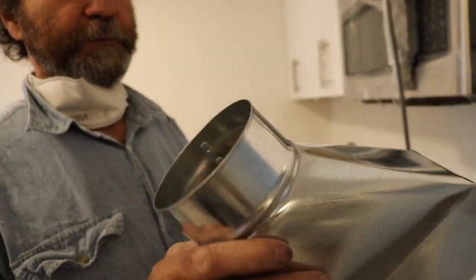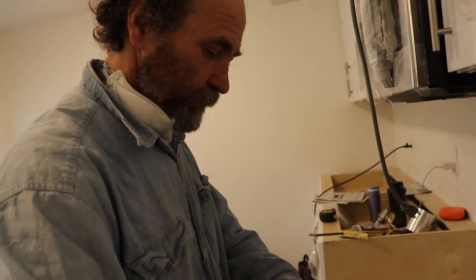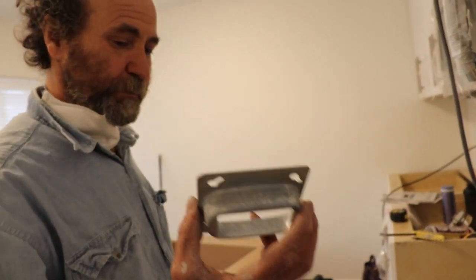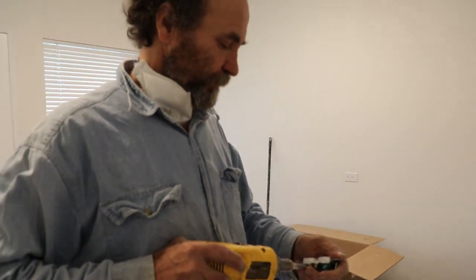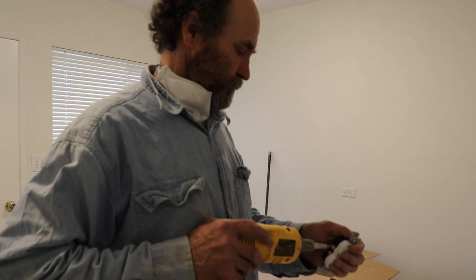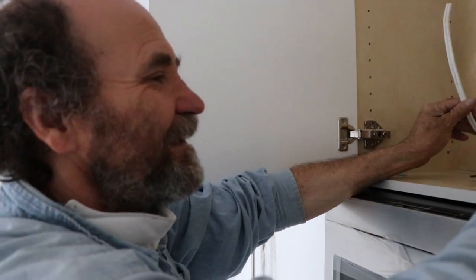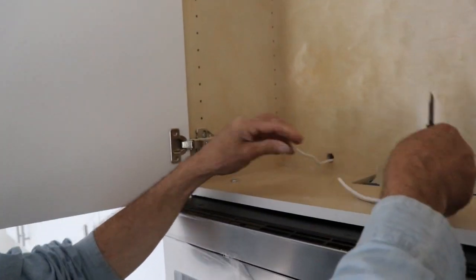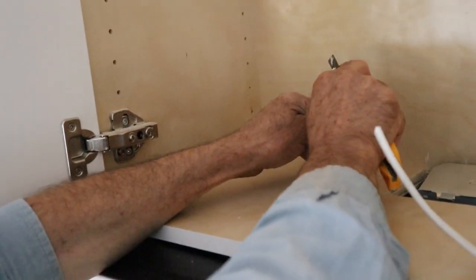I have one adapter, another adapter that I'm gonna use up there. I have to set up one plug — I'm just gonna use one of these plates, gonna screw it right on the back, and the plug will go right there. Make sure that the power is off before you connect. My wire here is a little bit too long, so I'm just gonna cut it and just leave enough to work with, then push it back.